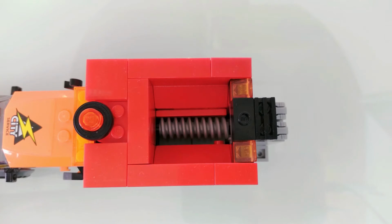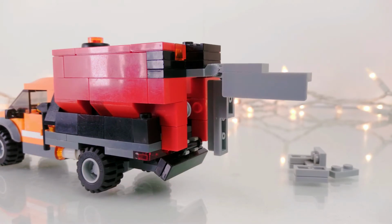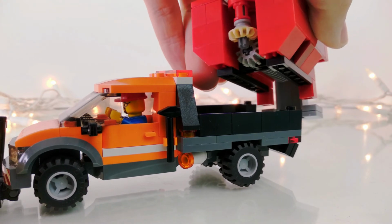There, as always, may be room for improvement, so keep that in mind if you have any ideas that may be different. The other important thing to note is to keep the gap/size of the rear chute as large as reasonably possible, as if you don't, the spreader will clog very often. This width that I used here still clogs, but pulling back on the chute slightly most of the time will discharge the clog. If anyone is interested, this is what the basic gear train looks like.